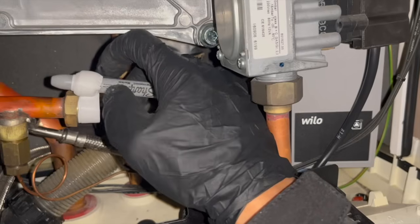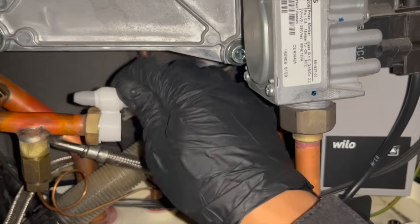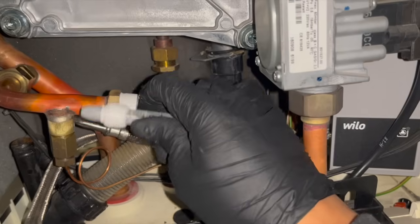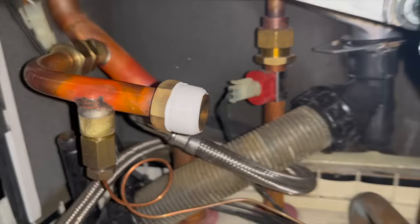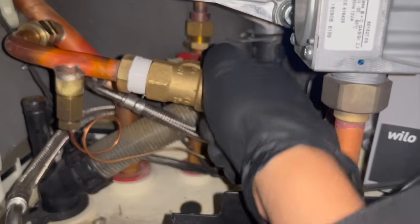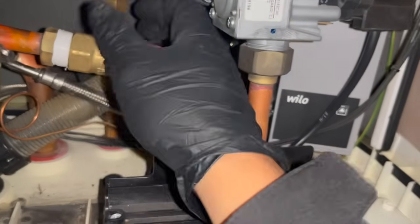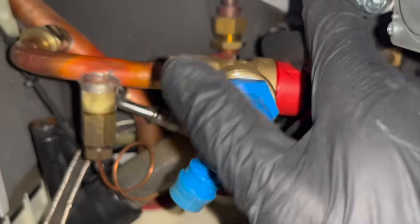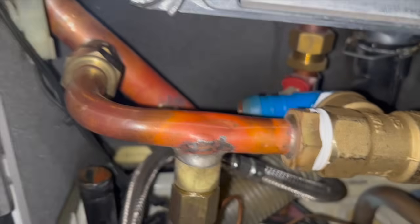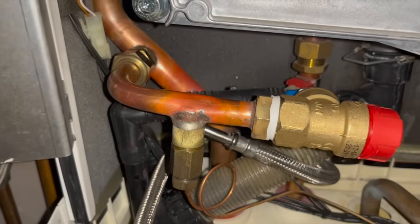In tight situations like this, you can use a pen, pencil, or screwdriver to apply PTFE. That massive roll of PTFE isn't going to fit in a tight spot, so wrap the PTFE around a pen and then use that pen as the roll to apply it in a confined space. On the final half-last turn, pop the blue elbow back in with some PTFE and rotate around. Then pop the rubber tube back on and the PRV is all done.